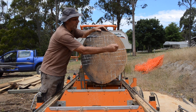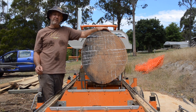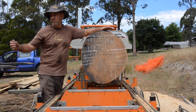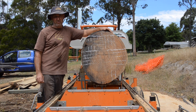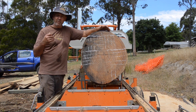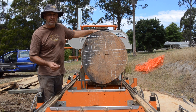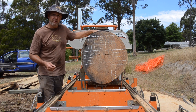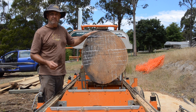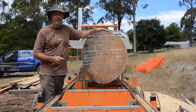The recovery — the amount of boards I'll get from that whole log — will probably be about 50%. So 50% will end up in the waste pile, 50% will go into the solar kiln to be dried. Now that sounds wasteful, but I like to think of recovery in terms of quality of log. This is about 85cm in diameter, midway average. There is about 1.5 cubic metres of wood here, and I hope to recover well over half a cubic metre of quarter-sawn board.